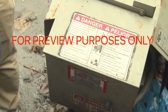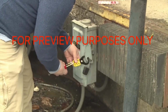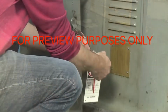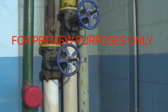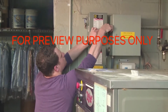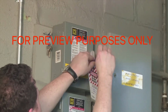The idea behind lockout-tagout is fairly simple. The object is to disable a machine while it's being serviced by isolating it from a source of power, or energy source, so it can't injure anyone who is working on or around it. To do this, locks, tags, and other mechanisms are placed on energy isolation devices, such as electrical switch boxes and valves. The lockout step shuts off or isolates the machine's source of energy. Tagging the machine tells other people the type of work that is being performed on the machine.